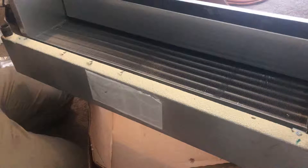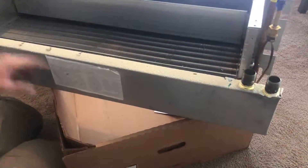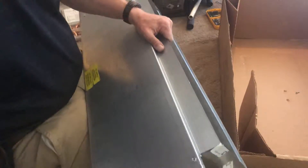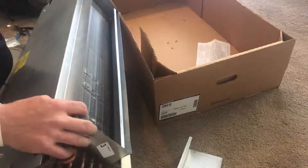You've got your drain connections — one connection here and one there. We're going to cap this one off and put a female adapter on this side. On the other side — which is out of frame — we're going to put another cap on that. Because of the way the drain pan is designed, I like to bend the opening down just a little bit so I'm not fighting to get it back in.